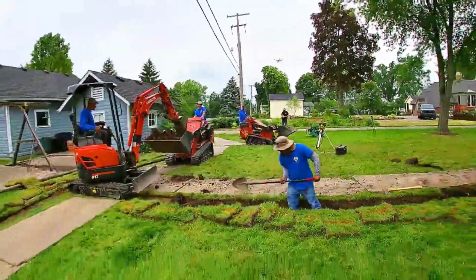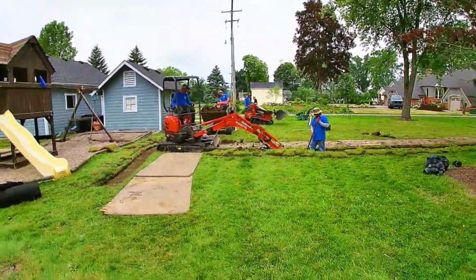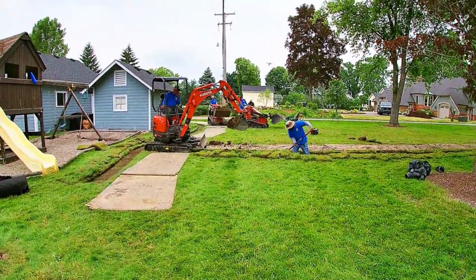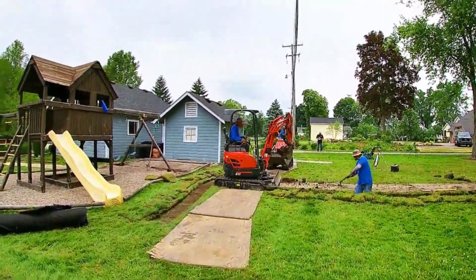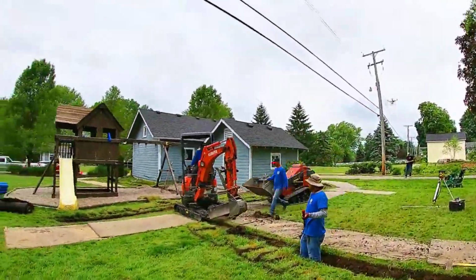I mean, after you spent all your hard-earned money on a nice new dump truck, and now when you overload it, it can't dump it. I mean, you don't want to be in that position. I have been, and it only happened once to me, and everything after that gets overhoisted. I step it up to the next hoist, even if they look at me like I'm crazy, because we're going to overload it.